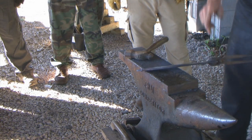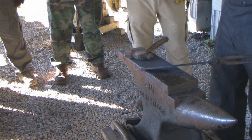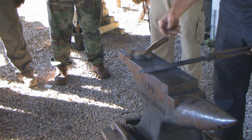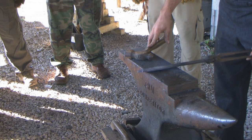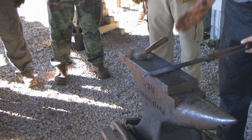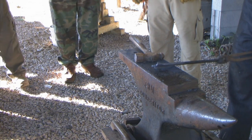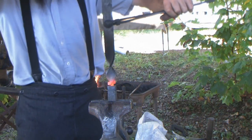Then the rest is your twist. If you want to make a perfect spiral, that little wobble won't bind you up in the hole. I'm going to make it a little more narrow just to get it a little closer — I've got plenty of width, but it's always easier at this point to square those edges anyway. Always draw it a little wider when you get it out the next time, just dress up your corners. If you get it too narrow you can never widen it back out.